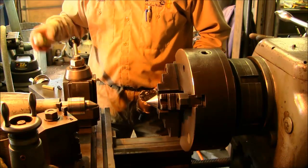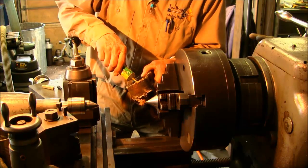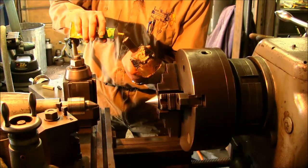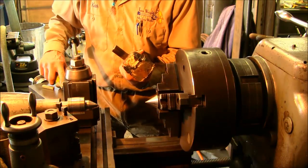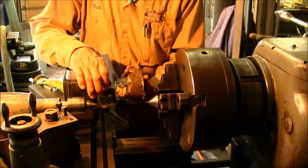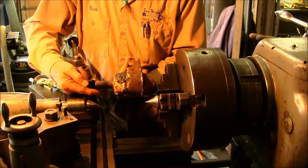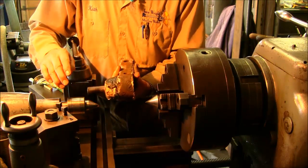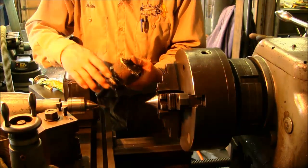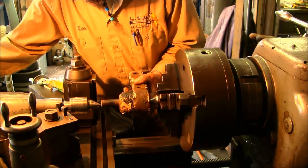And this extreme pressure lube, anti-scoring, is very, very common here. You can get this in your machinery trade. I go ahead and I put it in both, and people say why? Because you've got the live center in the other one. Even though we did as close as we can to it, there is a chance that this axis could be slightly off, and not so much round and round, but the action like a universal joint. It's just good practice. Also, if you have a lot of times where you switch your part around, it'll automatically have some dabbed in on there. All right, it's not that it's a big deal, and it's not wasting a whole bunch of high pressure lube in my mind, so I put it in there.